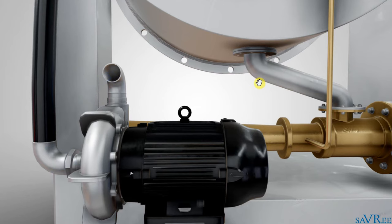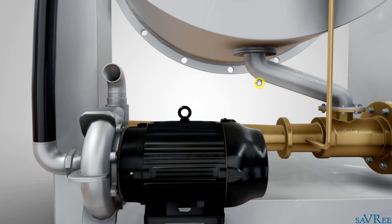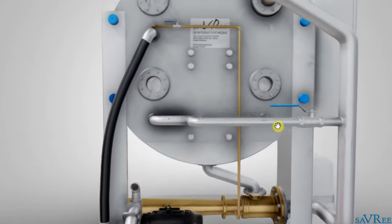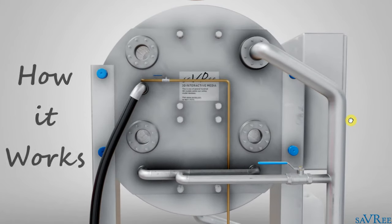The type of water we get from a fresh water generator is distilled water, or distillate. If we correct the pH value, add some minerals, and use things like a UV filter to kill bacteria, then we can turn this distillate into drinking water. So now we know all of the main components — let's discuss how it works.